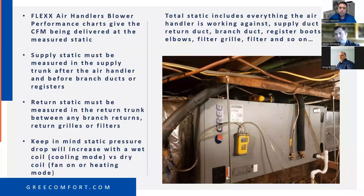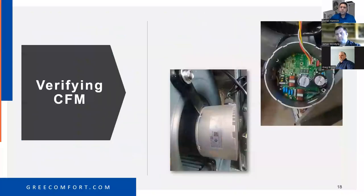There are even more tools out there now where you can not only measure static pressure but also wet bulb, dry bulb, and all those measurements — and you can see the BTU performance of that unit. It doesn't take an ungodly amount of time, and a lot of these tools can give you an email printout to show the homeowner or keep in your file that the system is performing properly.